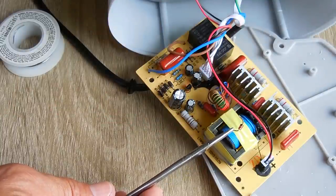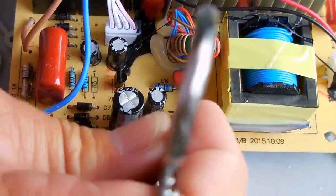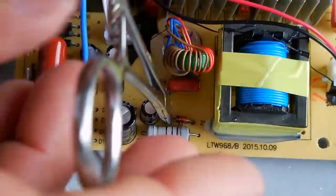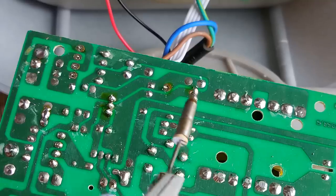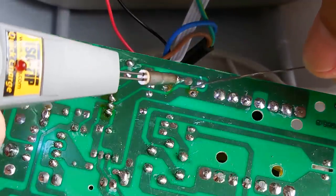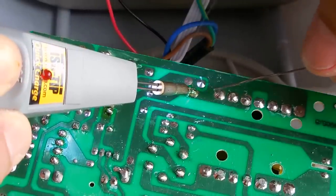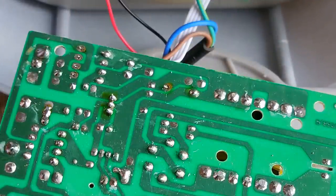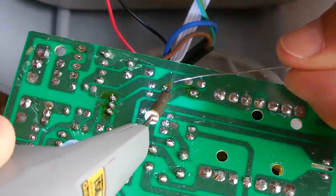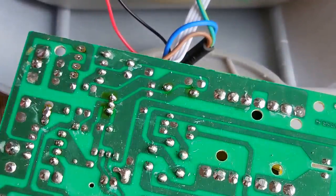Okay, let's reposition this, solder it back into the board, and apply some power and see what happens. Cathode towards me. Okay. Going to be using the isotip soldering iron, cordless. And going to go right over here around the camera. That was good. Let me just make sure I got that all because I can't see it from my angle. Yep, and that looks good.